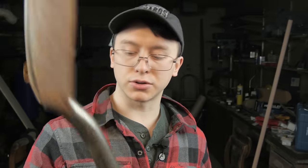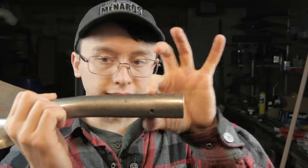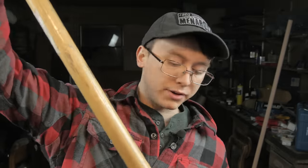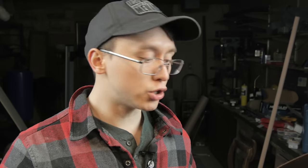Allow me to explain my cost-benefit analysis so you too can feel confident I've thought this through. Option number one: go to Home Depot, spend $6 on a shovel, pop these two rivets out, pop the end off, chop this bit off, and boom — you've got a slightly tapered, super tough steel tube. You also get about three and a half feet of ash wood, which is great for weapon handles, plus all this sheet metal you can forge and hammer flat. Basically 1/16 inch of hardenable, heat-treatable steel, all for six bucks and a couple minutes of your time.